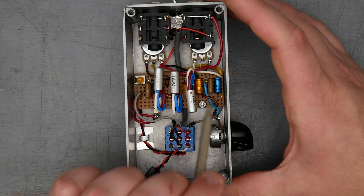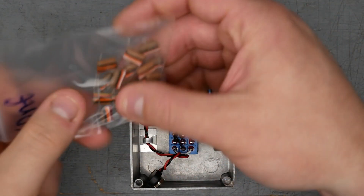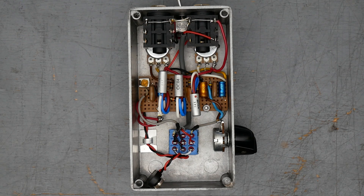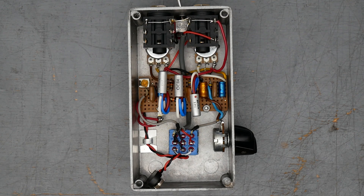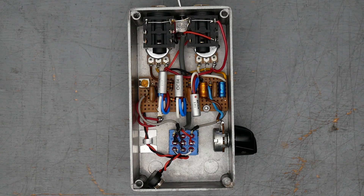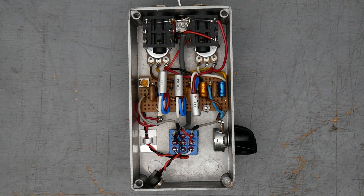First thing I see is a lot of mojo parts in here. We have some of these tropical fish style capacitors. They're just a different style of capacitor. I've talked about mojo parts in the past — I suggested that maybe it's not worth the trouble, and I'll stand by that. Generally speaking, I don't think the sonic differences are significant — it'd be pretty farcical to try to track down a specific positive tonal improvement to a specific part. Metal film resistors and capacitors work fine. Modern electrolytics are hardy and readily available. Mojo parts can also work fine, but they are much more expensive, hard to track down, and you'll often get bad or used parts. So maybe for a builder on this scale it works, but generally for the DIY crowd I don't know if it's really worth it.